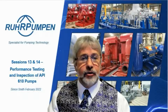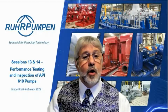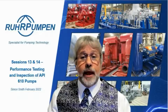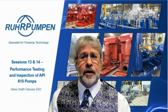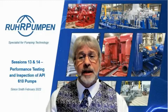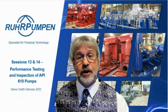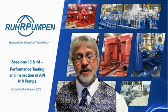Okay, I think that is it. I don't see any. Oh, I beg your pardon. Christian Flores has come in here. What is your opinion about witnessing the test? And the question mark, remote. Witnessing the test, yeah, I would want to witness a test if I were paying a lot of money for a high power pump. I might not do it for a standard pump or a straightforward pumping application, but if I were paying several $100,000 for an expensive pump, I'd probably want to pay a little bit more to go and witness the performance test. Remote testing is increasingly possible now. We can use cameras to record the figures. We've actually been doing that for quite a few years, so that's always an option that you can discuss with the project manager.